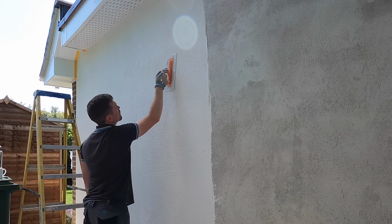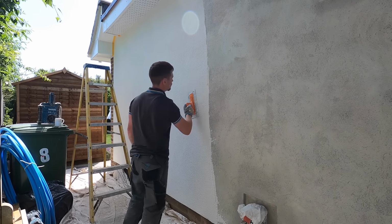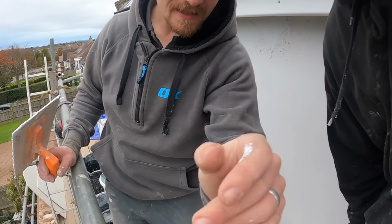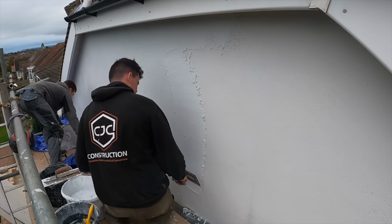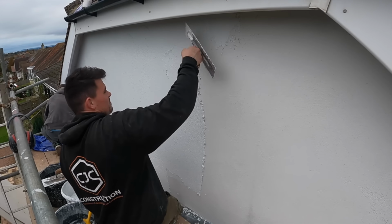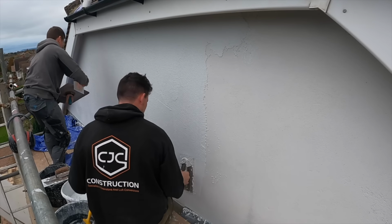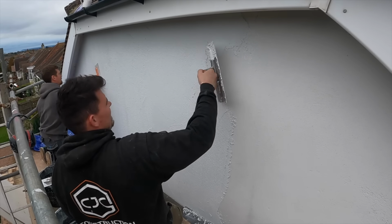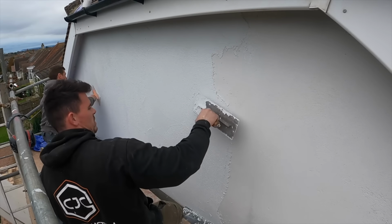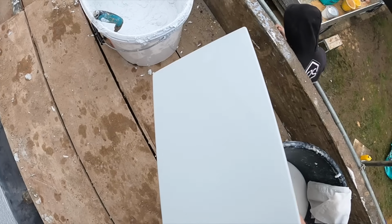Now ideally this product is better with 2 people, I must admit. Here's a clip where I did a previous video with my friend Charlie. Put your head in the camera. How's it going? Yeah, that was us. Now as you can see, the product is quite thick here, but the idea is you've got one person applying the render, and then I'm coming up behind, taking back the excess, and then I'm floating it up directly behind him. You save so much time doing it this way, and this is the float that you use.